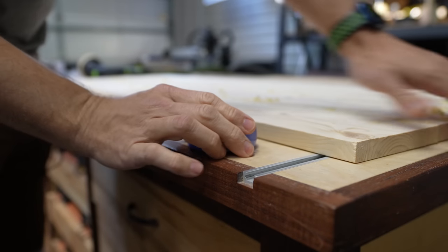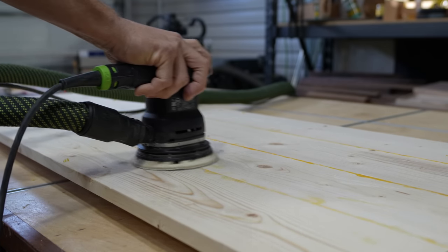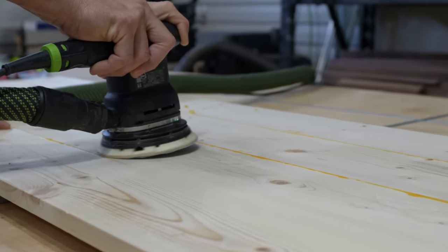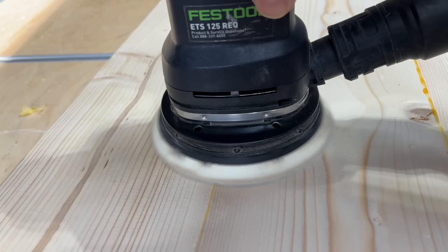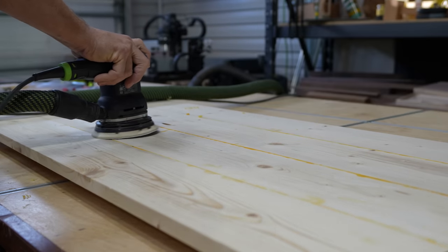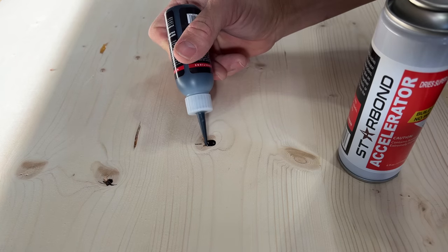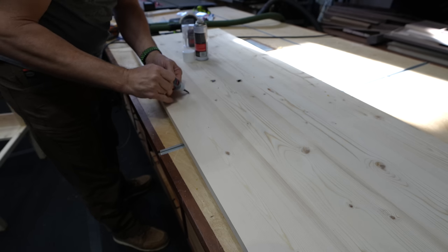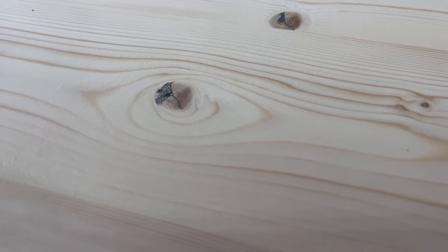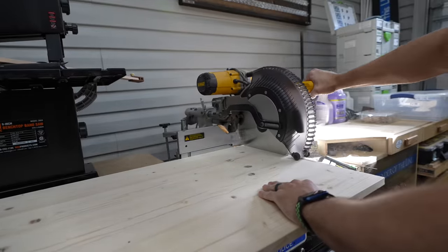I put bench cookies under the tabletop to keep it from moving around while sanding. Now, this is how you don't sand — do not sand this way. You'll see this edge of the sander digging into the tabletop because it was a little uneven. I had a little too much glue I didn't clean off at clamping time, so I went a little aggressive with the sanding. That causes swirl marks. For the knot holes, I'm using medium-thick black Starbond CA glue — you can use brown if you're going to stain it brown. This activator makes it set up in about 30 seconds. Fill the knot holes, sand them back smooth, and that helps solidify those knots and keeps them from cracking later. Make sure you change your sandpaper after you're done with that. Then I took it over to the miter saw and cut it to length — make sure you get two smooth sides.